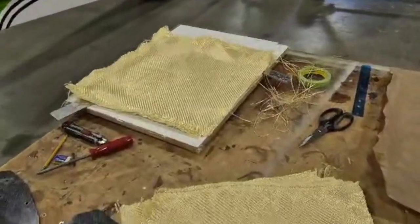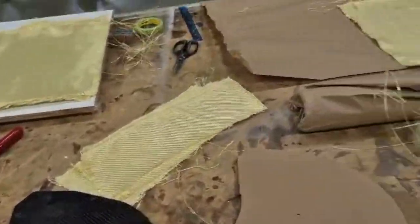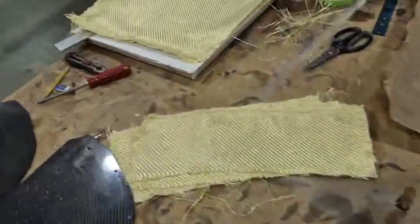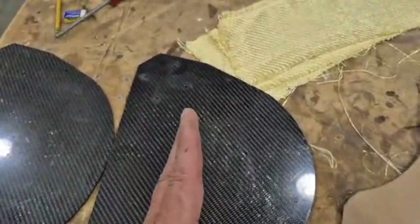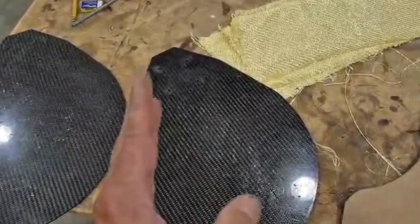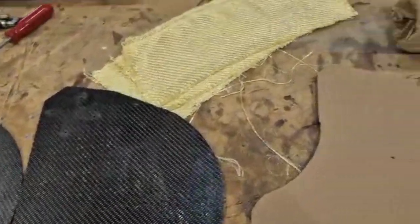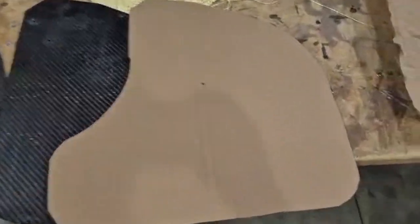Today is rudder making day. I thought I was gonna be making it out of carbon fiber, but I accidentally ordered Kevlar. It's actually gonna work, it's just not quite as stiff as carbon fiber. So what we're gonna do is go with two layers of carbon fiber on the outside, six layers of Kevlar, and then two layers of carbon fiber on the outside again. The design is also a little bit larger than the ones we first cut.